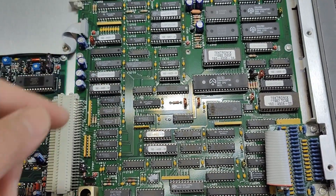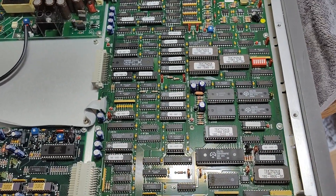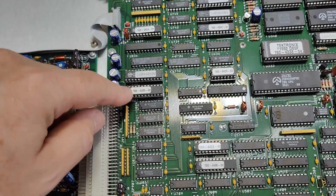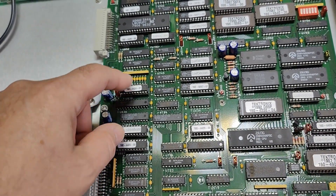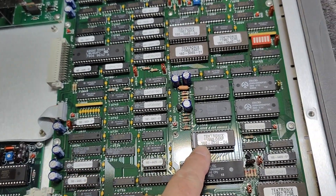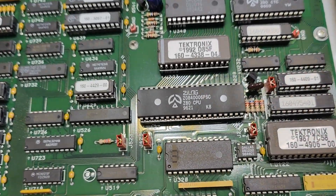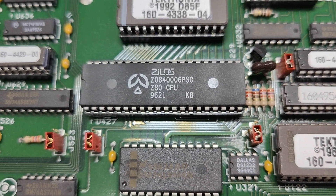If we look at the digital board, the chips with labels are of course programmable ICs that contain configuration software and setup for all sorts of stuff. The chips of this size will be some memory, but all these are programmable chips like counters and gate arrays - PALs, PEELs, and chips like that will be EPROMs containing 8-bit software. It can also be image graphics.